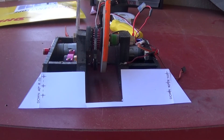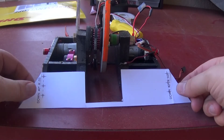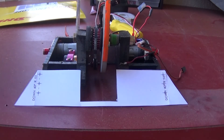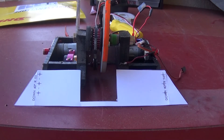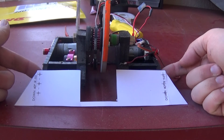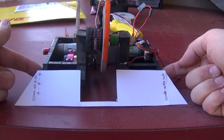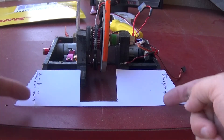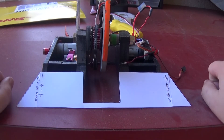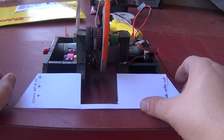So after the disaster that was the floating wedge idea for Demon Spawn, I decided to use this more solid wedge across the front. These triangles in the corners are going to bend back to try to defend against horizontal spinners at least a little bit. Basically there's going to be an extra piece of UHMW bolted on the outside rails on either side, and that's going to give the support for this new wedge. There's a gap in the center for the disc to go through, but now that I'm looking at this, I'm realizing that center hole is off-center, so I may have to play with the dimensions on that when I cut it out.